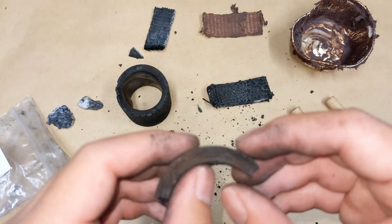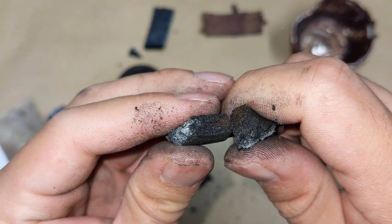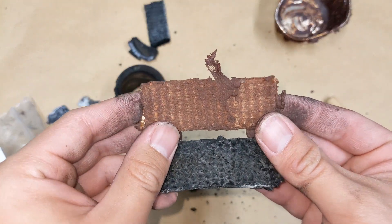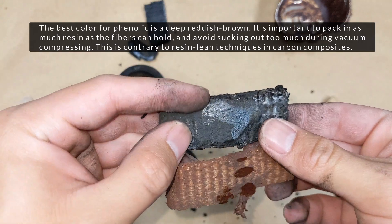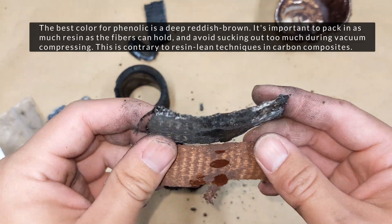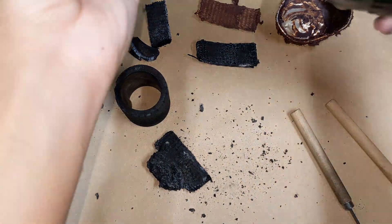Of course, we have the fully charred sample here again. Here are these two side by side — original pre-burning and then post-burning, 20 seconds or so of oxyacetylene. Most of the material is still there. Of course, when you apply pressure things change a bit, but we know that the silica performs well under pressure as long as it's well laminated.